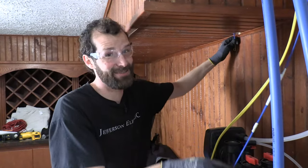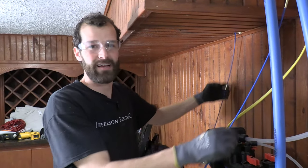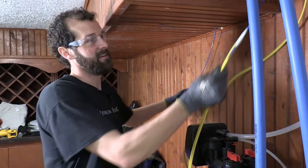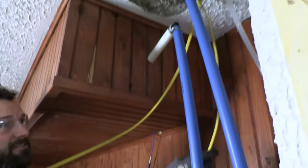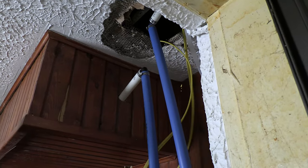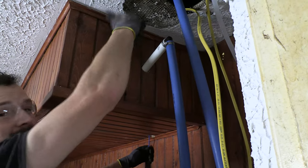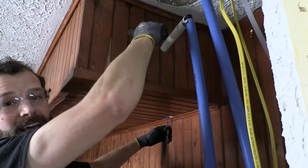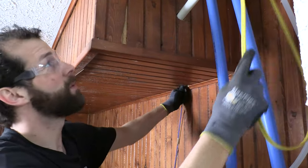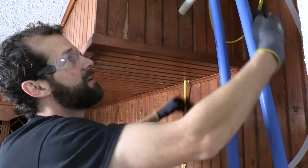The fish sticks did get through there — not easy, but it happened. Now it's all taped up with nice smooth edges. Go slow, don't want to lose your fish. Every time you get stuck, back it up a bit and wiggle. I actually took a slightly different route — I reached over the top of the bulkhead, busted a hole through, folded back the metal edges, and used the bulkhead to transfer over to my hole. Slightly different approach, but very necessary.